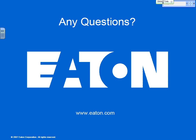So switchboards have a UL standard. You notice from the pictures, I have to take the back cover off, everything's open. You've got breakers in there, you've got horizontal bus, your cables are connected. There's really no barriers and everything's open. So if anything faults in there, the fault can spread and cause damage. It's designed to go against the wall and be a compact, low-cost, economical footprint and design.